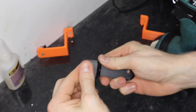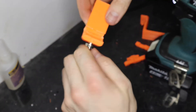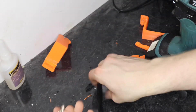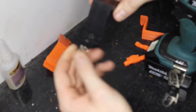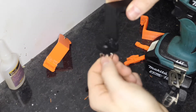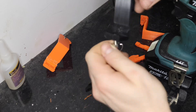I'll do the same again on this bottom piece. Hopefully that should now be wide enough so when I put one of these bolts through the screw thread shouldn't bite too much and should almost fall through. It will still catch a little with the thread, but it's not forcing the plastic out and causing it to crack, which is what I didn't want.